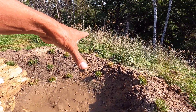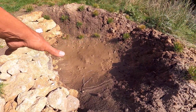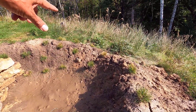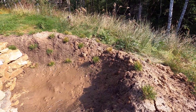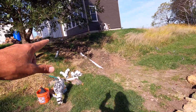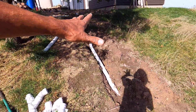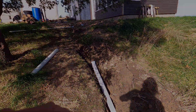I'll get in here, plug that up with gravel, shovel some of this dirt that made its way down in here back into it. It'll take a while to get this stabilized with roots and stuff, and I need to put in my overflow drain — that was going to happen anyways, I just never had the time to do it. But for today, I'm going to get this finished up, get it all connected and backfilled before I lose all of my dirt here, and hopefully that'll stop the water from funneling down into this area.